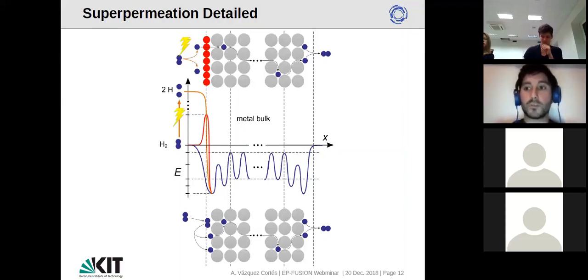The pressures are adequate. The pressures after the ITER divertor will not be very different from the pressures in the foreseen DEMO divertor, but there is still a long way for ITER to operate with deuterium and tritium and have burning plasma, and therefore reasonable amounts of helium to separate from the fuel mixture.